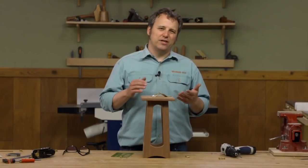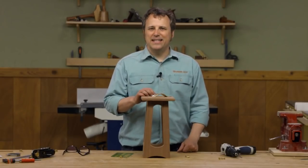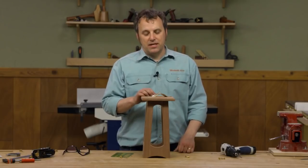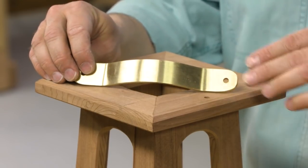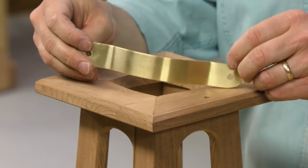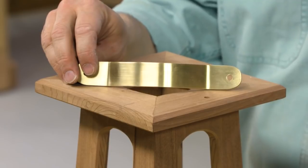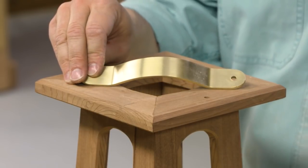What you'll find from all the handling we've done on the bar stock is that it's going to look a little scratched up and dinged. So I used a sanding sponge and sanded all the way across on all the sides and edges just to give it an even sheen and consistent scratch pattern, especially on those show faces.